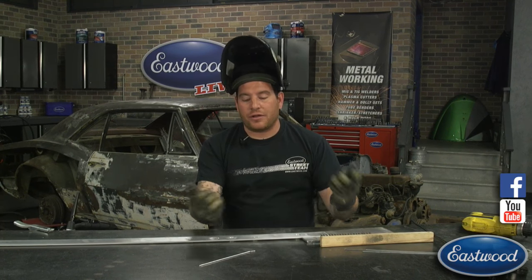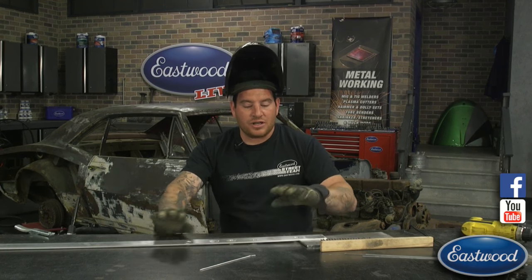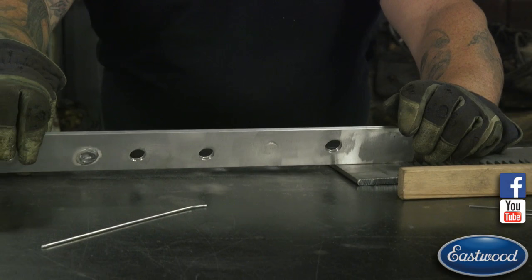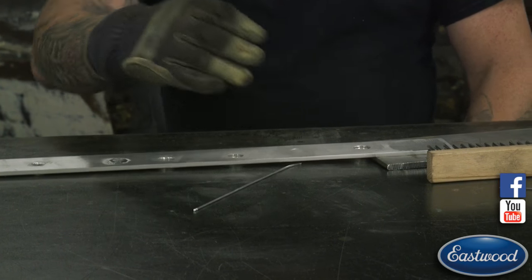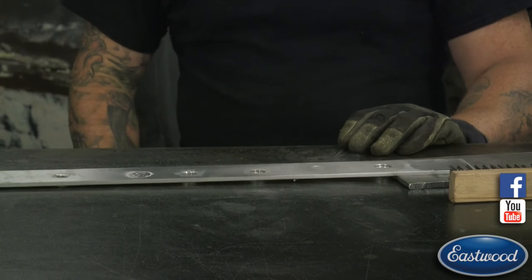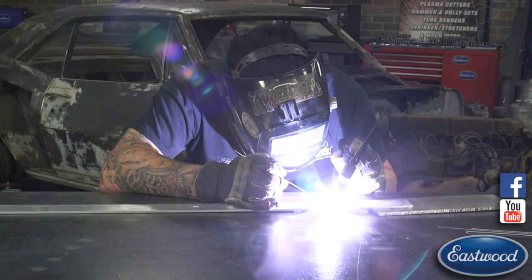And when you go to start putting molten filler rod against it, it may actually have some impurities that'll pop up through it. The other thing I wanted to show is that you can't always get a copper backer back there to help you. You don't always have that help. So I was trying to show this piece up above, a little more difficult. But in the real world, I find most times when I'd like to use the copper backer, when I really need it, I can't use it. But yes, you could use the copper backer. I would just make sure that it's very clean before you use it. So I would almost hit that with Scotch-Brite and everything and clean that up so that you're not dropping weld down that's touching it that then has impurities on it. So I'll keep using that area real good.